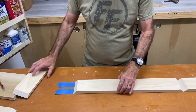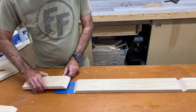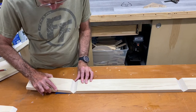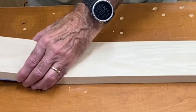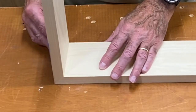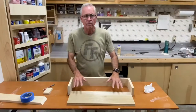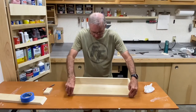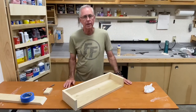A cool trick I'm trying here is you take your 45-degree angle pieces and put some tape underneath, then take your other piece that you want to fit into the 45 and just drop it right on that same piece of tape — make sure it's joined on there really well. When you lift it, it'll close up that angle really tightly so you can glue it and brad nail it. So we're going to put some glue on here, glue these up and brad nail them. The bottom of the shelf will slide right in, and then we'll cut the top piece and start putting this all together.